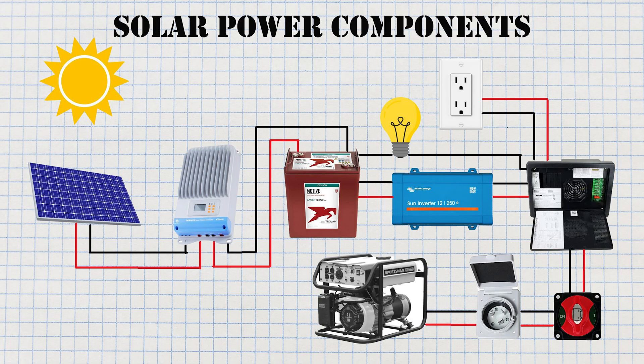We flip a switch, and once the breaker panel detects AC power coming in from the generator, the built-in converter kicks in and starts to recharge the batteries. It's also important to have the proper fuses at various points throughout the system to protect the components from excessive current. We'll cover how to correctly size your fuses in greater detail later in the video.